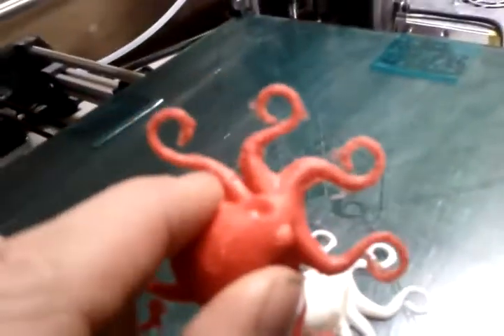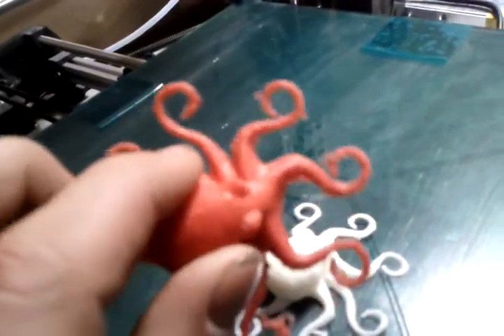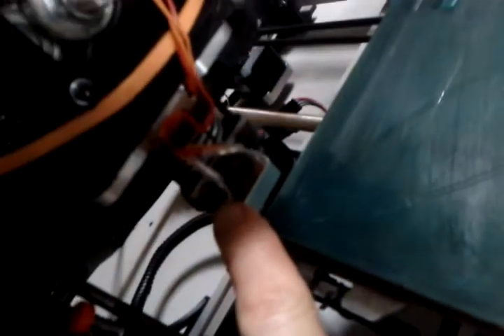This is the original one. I think this little bit of distortion on the legs is because we had the z-height too low. So this is the adjuster here — I'm going to turn it so that the height of the printhead is just a little bit higher. I'm going to try half a turn.